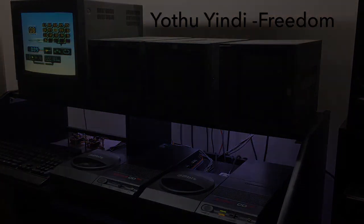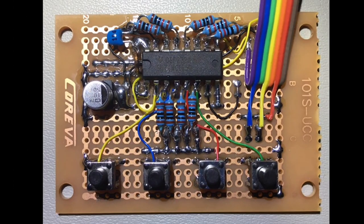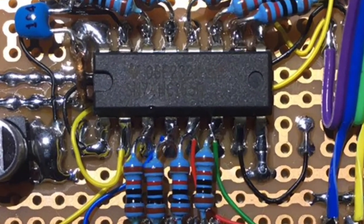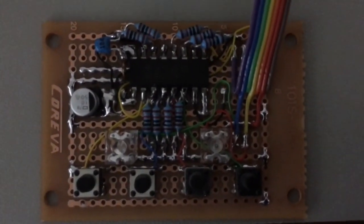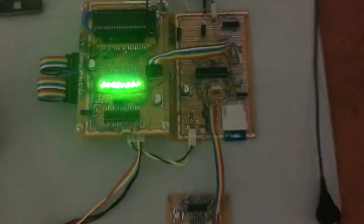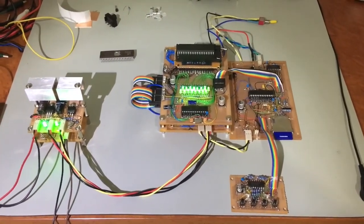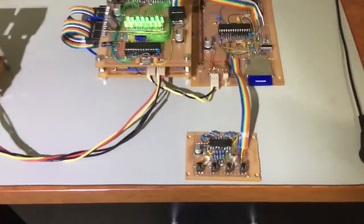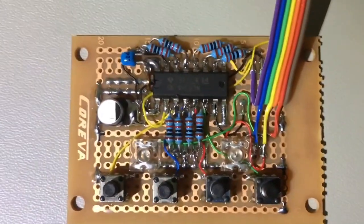Now, rather than reprogram the microcontroller every time I want to change a mode, I've made a parallel shift register button board just to save one I/O pin on the microcontroller. It would have taken 4 pins to use 4 buttons directly, but with this I've got it down to 3. What a saving. I meant to show some software on this video, but we had a power blackout for 5 hours with scheduled maintenance, and I needed to get this footage off my phone anyway. That'll have to wait till the next video.